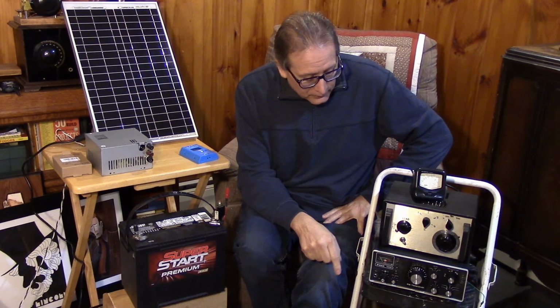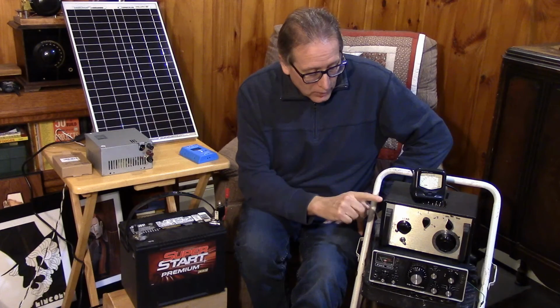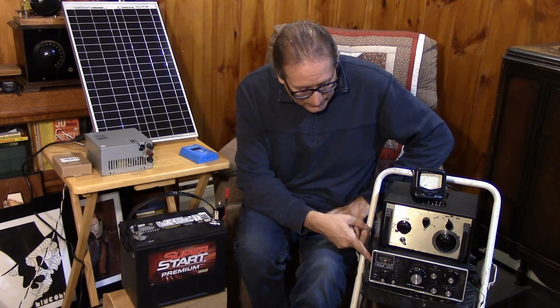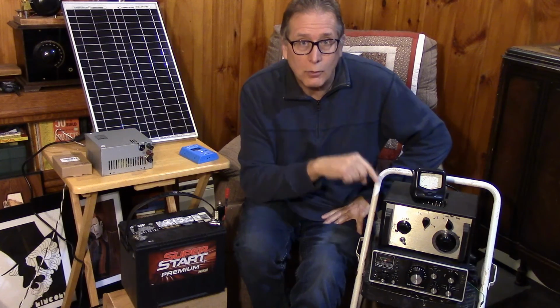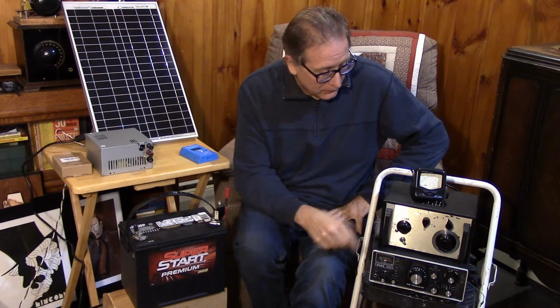I also want to talk about why these solid-state type transceivers like a small tuner between the antenna and the transceiver. Not as much to do anything with the antenna, but to allow the radio to present the full power to the antenna as sort of a matching network. And this is a very simple tuner we'll go over. It's basically just a pi filter type tuner with a tapped coil.